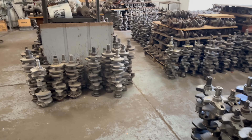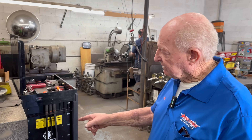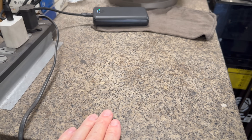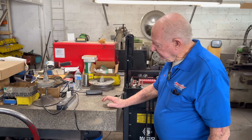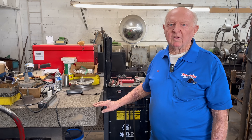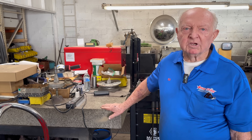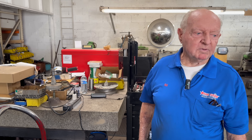Here's another machine you might look at. There's a machinist's marble table — why would a machinist want a marble table? Because it's perfectly flat. It's got adjusters on the legs to make it completely flat. CNC machine shops have tables like this, even bigger, that they do their measurements on for specific specs.